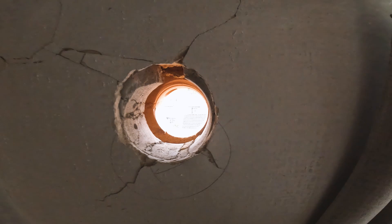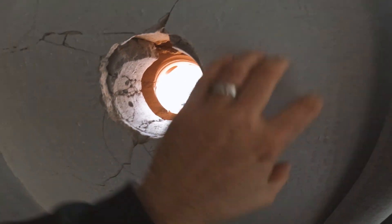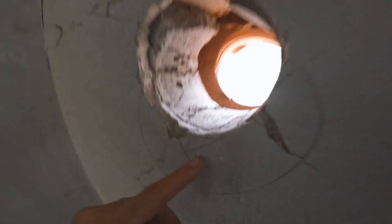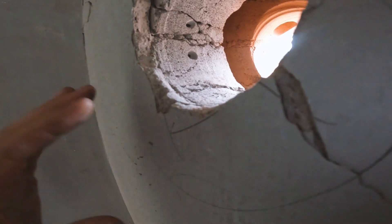Holy moly — and there's outside, right? So obviously it's called that out, that's going to be where the fan is, and all the plaster's a bit loose around here. We've got to get that fan in. So what we're going to do: we've glued the grill on the outside of the duct tin. Before that, we got the duct tin and made sure it just sat just behind the lip of the front — about five mil play we've got with it — then we glued it on. So then what we're going to do is send some one mil down, tie on, and then pull it back up, and hopefully it doesn't come off.